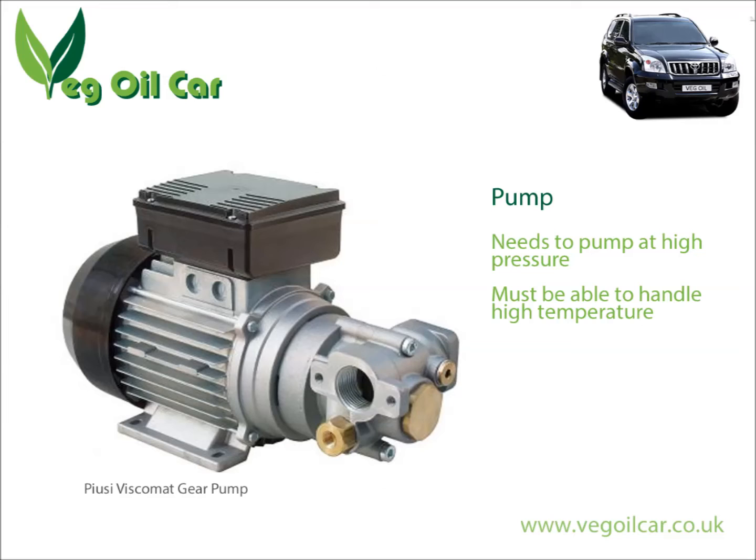The pump needs to produce pressures of around about 7 bar — that's quite typical — and it needs to maintain that, because it's forcing the oil through very very narrow apertures, tiny pinholes. That force needs to be steady. The pump is the beginning of everything, and you're going to need to spend quite a bit of money on your pump if you want one that's going to work for you. Next, of course, you've got the container — usually a steel drum. The reason people use a steel drum is because you can bolt the centrifuge onto the side of it.